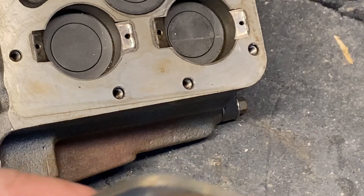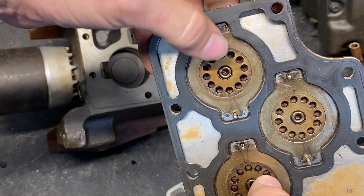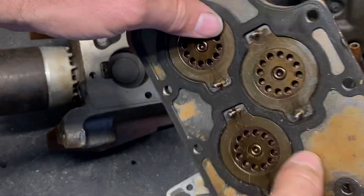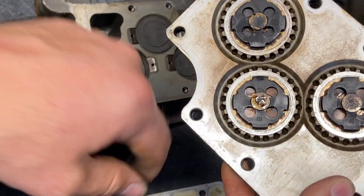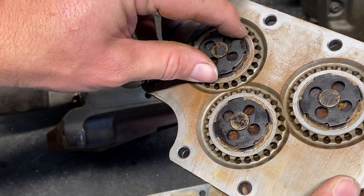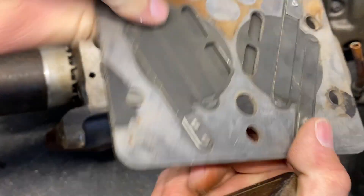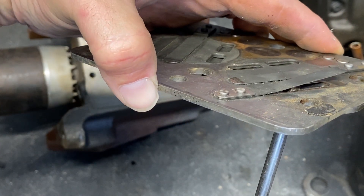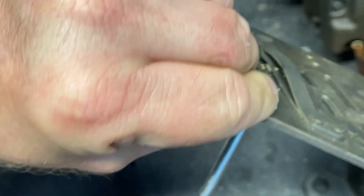There are many different styles of valves, and a lot of them now are circular valves. These valves have a similar design, but they allow the compressor to pump refrigerant out to the very center and pull it in to the very top. Instead of long flat reed valves, they're using a circular valve. There are two different valves on this head. One plate opens to the suction side — it sucks this valve plate open — and as this one is also being sucked open, then on the discharge side it pushes this one open in the opposite direction. It's essentially the same idea as the reed valve plate.